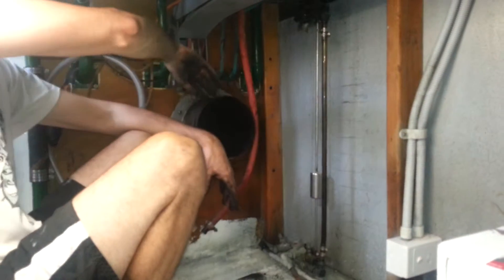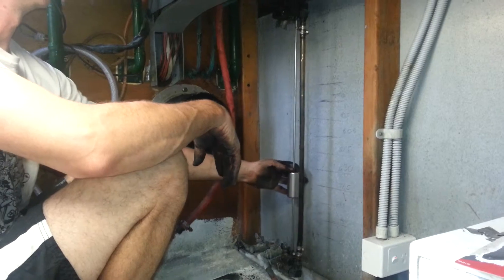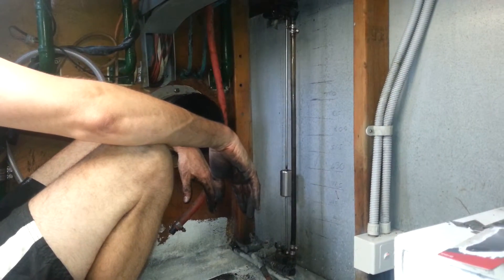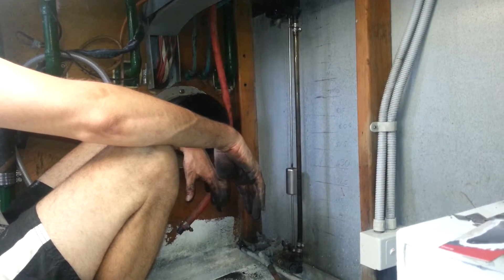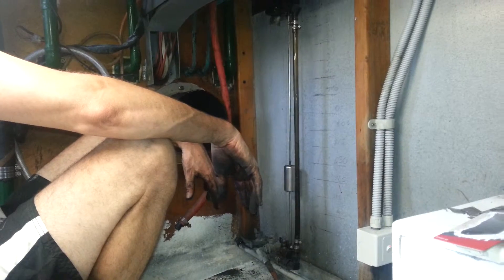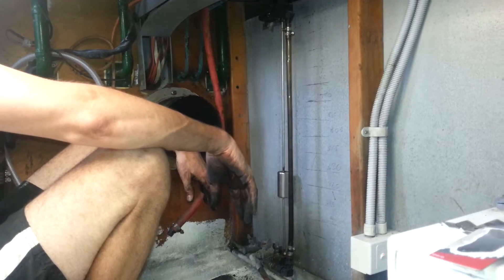So the pipe runs along there? Yeah, that's just a mount for the muffler. It's a fairly harsh area — the exhaust gases are quite corrosive, and with water it's a fairly hard environment. Even with stainless steel you're going to suffer some pitting. So if the mufflers are at the end of their usable life, we'll replace them. Or if they can be repaired, we'll do that.